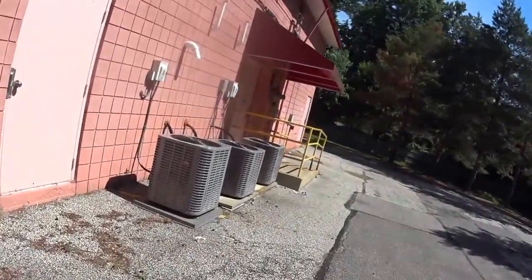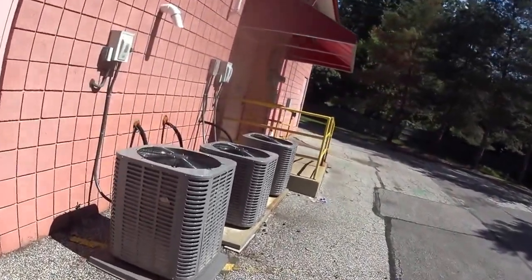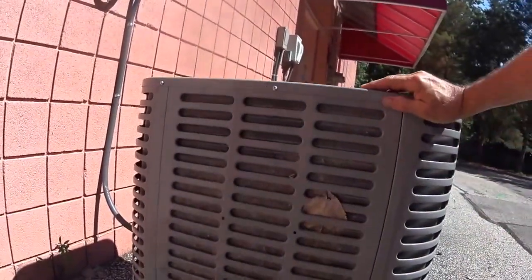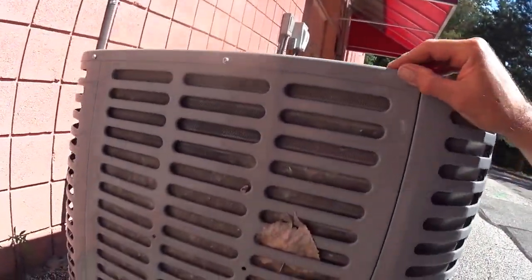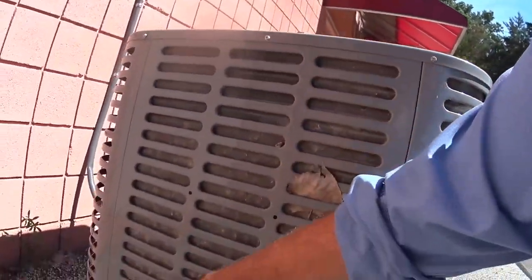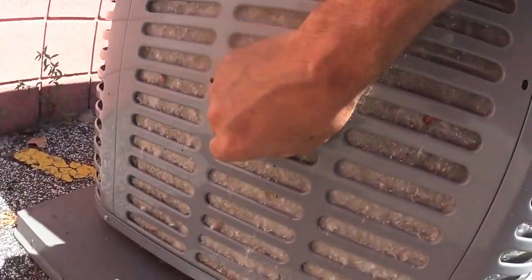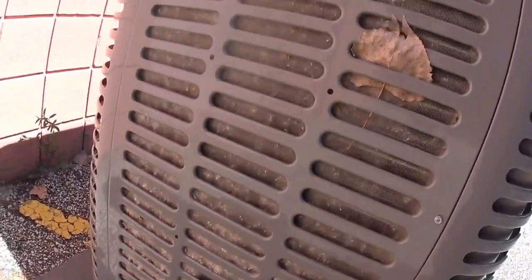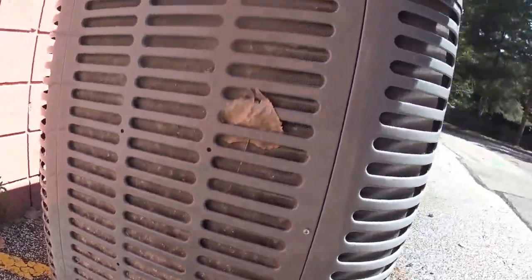The point I wanted to bring out — we have this white fluff that flows around and gets into these air conditioners. This one's not too bad, it's fairly vented, but you can see the fluff down here. It's plugging up the coils pretty good.